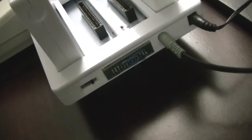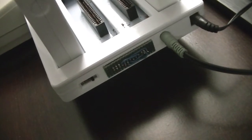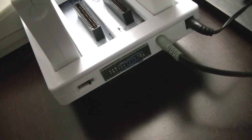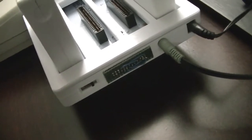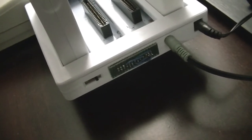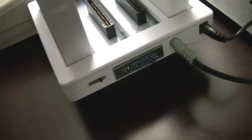So here's another one, and there's a little plug there that you can see on the TTL serial UART interface port — I just got it wired so that it wires each of the UARTs to one another so I can test them by communicating back and forth between the two with the same machine.